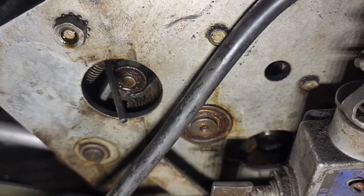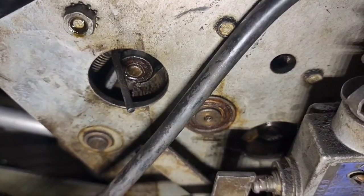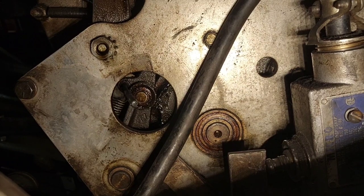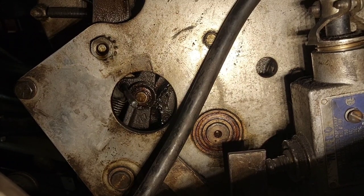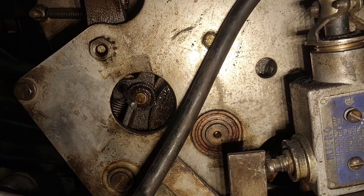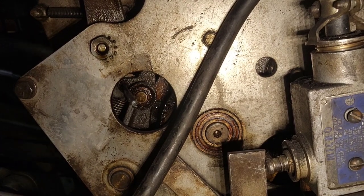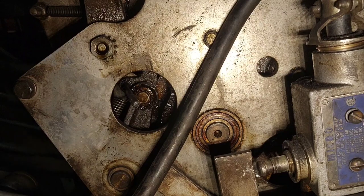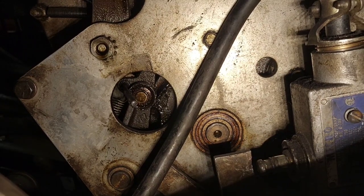I'm wondering where this thing is messing up — we need to do a little more research. We're going to go through a first ball standing pin cycle and watch that detector. Good, that's what it should do on a first ball standing pin cycle. Now we're on second ball, going through a second ball high-level strike detection.